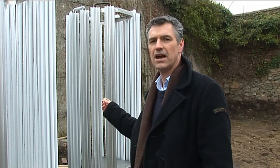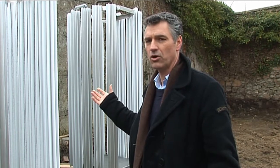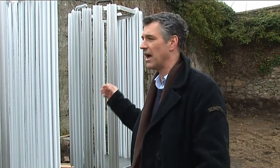The Caloric ice sticks only take the heat from the air that the building needs. As you can see here, it's a reasonably mild day — not too cold — and the ice sticks are half iced up. Whereas in very cold weather, when the building needs a lot of heat, they will adjust and take more heat from the air to heat the house.